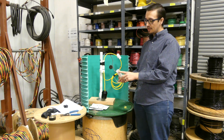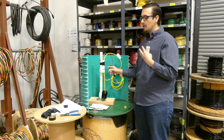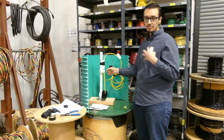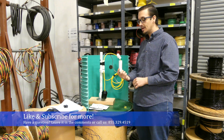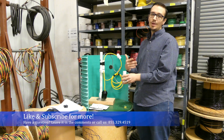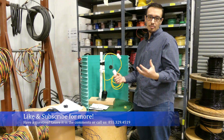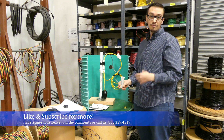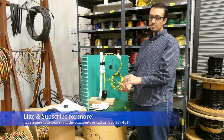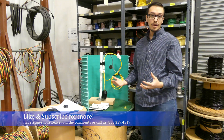When it comes to the vials: the three-quarter inch PVC is intended for a single float switch — there's not a lot of room for multiple connections. The larger one-inch vial is intended for larger wires like a motor wire, but we have in the past done a motor wire and a float together in one vial when you've got a single float running a pump. You can easily fit two splices in there. That sums up the sizing options. Don't forget to like and subscribe, and we'll see you next time.